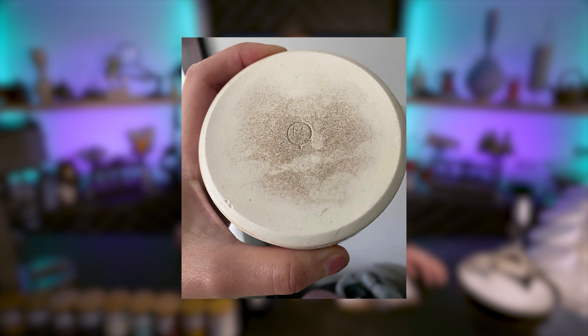So what does the absorption value mean and what is it really telling us when we look at it? In short, the absorption value is telling us about the vitrification of the clay. Vitrification is the process of forming glass inside our clay bodies, and it's a really important part of the firing process. When we form glass in our clay bodies, that's what makes them tough, durable, and resistant to growing bacteria and mold.